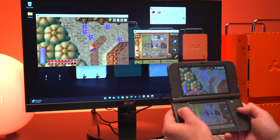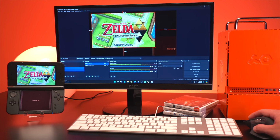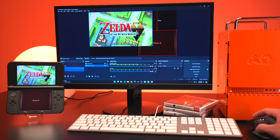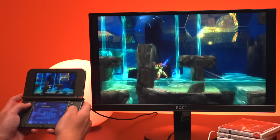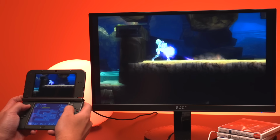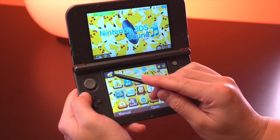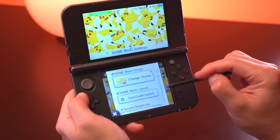To me, this is a purpose-built mod. It is predominantly meant for people who stream 3DS content or have some other need to capture 3DS footage. This isn't a consolizer and shouldn't be treated as a device to play the 3DS on a larger screen because at the end of the day, you still need to use the 3DS's onboard controls. There's no real way to hook up an external controller given the unique input configuration of the console, i.e. the touchscreen. So for what it is, it's great.